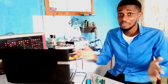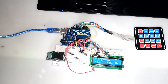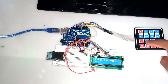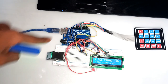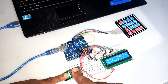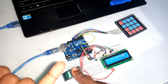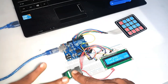You can easily adjust yours in the code. Now I tried again using another registered finger, but this time I decided to use the wrong code. The system figured out the wrong code and didn't open the door; rather, it returned to the initial state. With this approach, every user of the system must first have their fingerprint recorded and also know the password. Having only one protocol is not sufficient — a user would be granted access only when they have both the password and the biometrics.